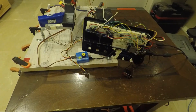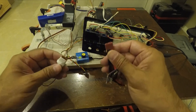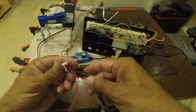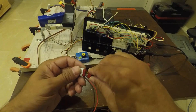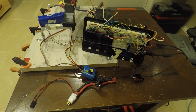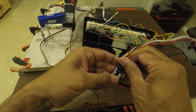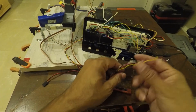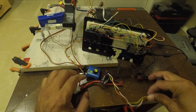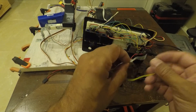After assembling both sensors, we are going to put together the voltage and current sensor and attach it to our motor and battery circuit for actual testing. I'm attaching the voltage sensor closer to the battery and connecting the sensor cable to the Arduino. The ACS758 Hall Sensor module has two outputs; in my case both produce the same result so you can use either one. Note that the Hall sensor does not work at 3.3 volts — it requires 5 volts to operate.